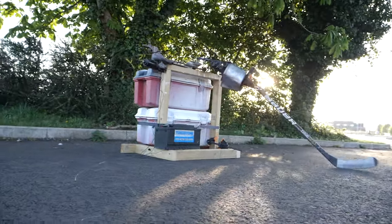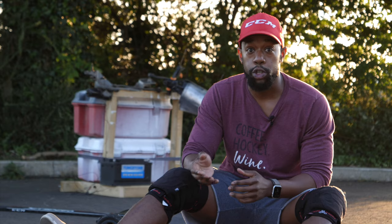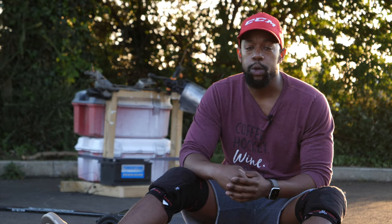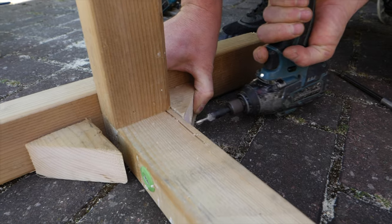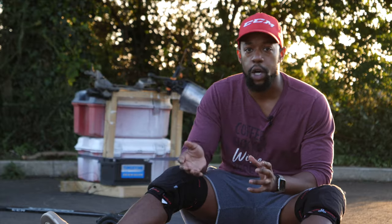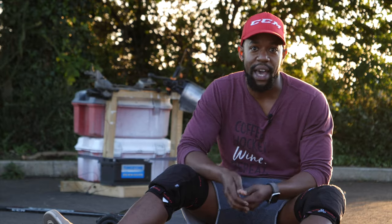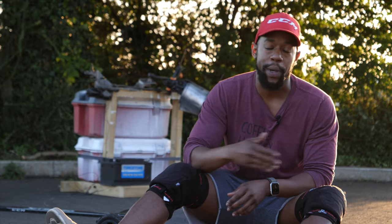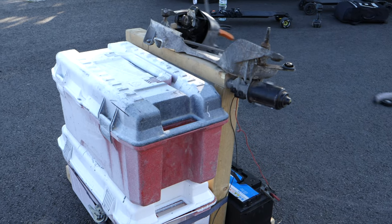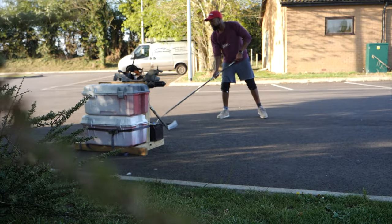After doing all of this we hit a perfect speed — comfortable to stick handle but still challenging. We also added additional wood pieces to the sides of the frame for stability, judging how much was needed by turning on the assembly and seeing how much it pivoted and tipped while swinging. It's important to mention that after building the frame, you should add sandbags or any weight to fix the frame to the ground so it doesn't tip over. For our example, we used two toolboxes mounted to the back of the unit, plus a ratchet strap to secure them so nothing shifted while the motor was running.